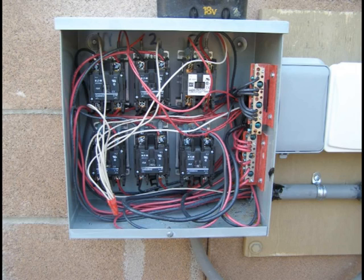Eight: the contactor activation wire is a series of white number 12 wires connecting seven wires. Again, a suitable size connecting lug should have been used and insulated with rubberized tape.